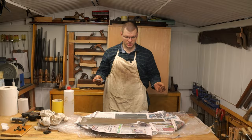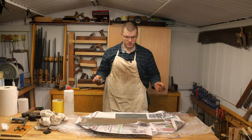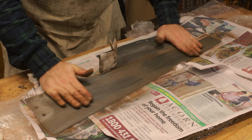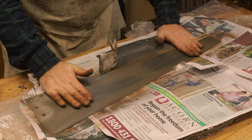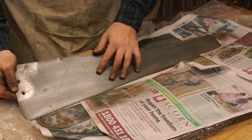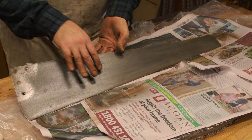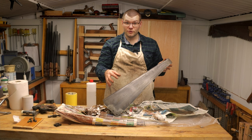Always go in the grain of the metal. Metal does have a grain and it's usually in the longitudinal grain, so normally in the length of it. Looking at this now, it has smoothed out much better than before. If you look closely there's more metal showing through, but it is keeping the darker marks — which is your patina and not necessarily rust in this case — and it's also shined it up to a degree. Now that I've used the 240 grit on this side of the plate, I'm going to go ahead and do the other one.